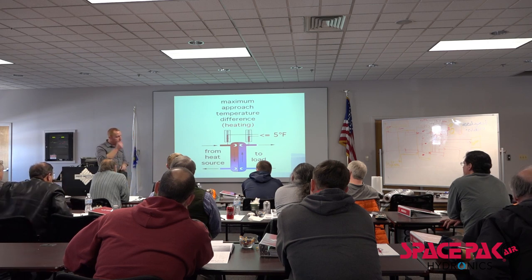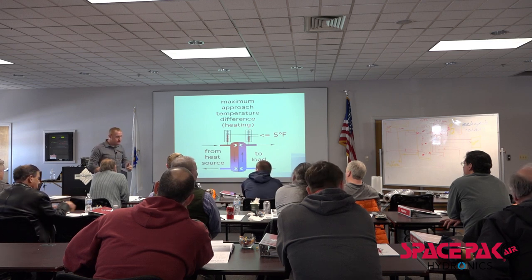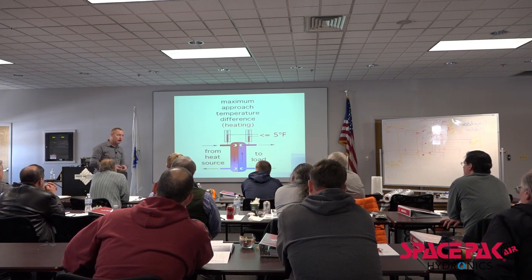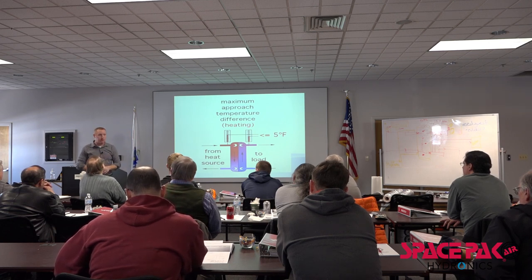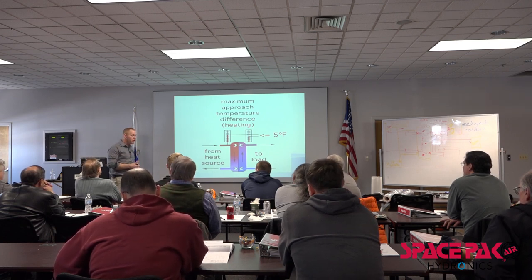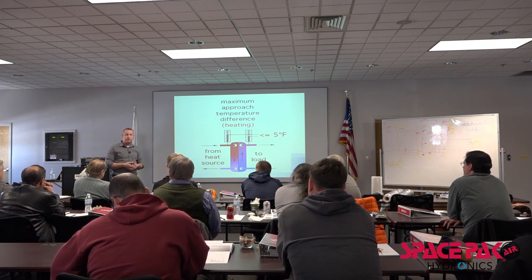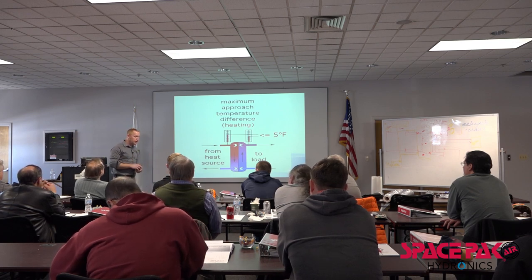I know that glycol, that antifreeze, people don't like it. Just as some of the other things are in the industry, it's a way to get back in the door. It's a way to sell a service contract with an easy, okay, you're still at that 35% glycol mixture, you're going to be good for another year, Mr. and Mrs. Jones, right? Or, you know what? It's kind of getting diluted, it's been a couple of years, so let's freshen it up a little bit. But it gets you in to see the systems.